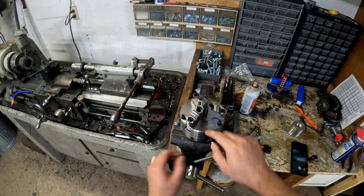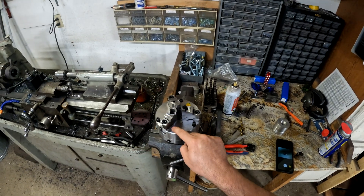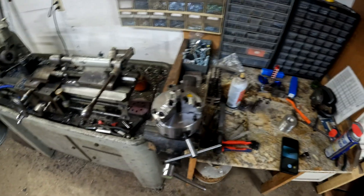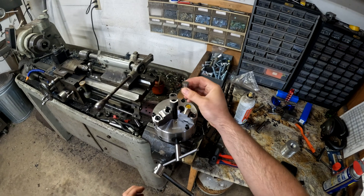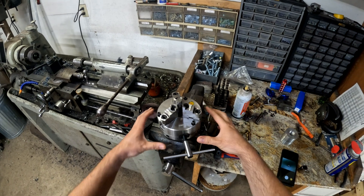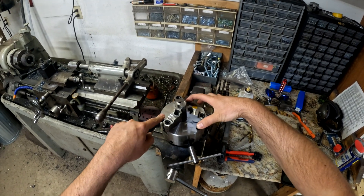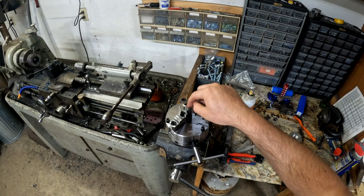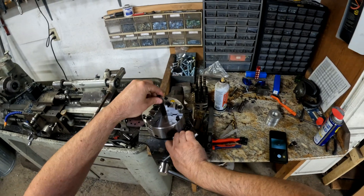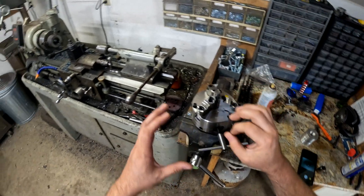The scroll is the gear inside. Because every time you clamp this same diameter you're engaging the exact same teeth at the exact same spot, you should have very high repeatability. So if you know you're going to make a whole bunch of parts from this diameter material, you chuck a piece in, put your indicator on, adjust the entire chuck with the set screws to eliminate the run-out, tighten the lock screws down, and then machine one side, flip it over, and machine the other side — with literally zero run-out, super fast.